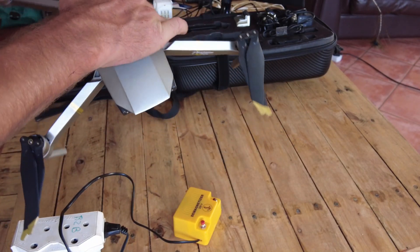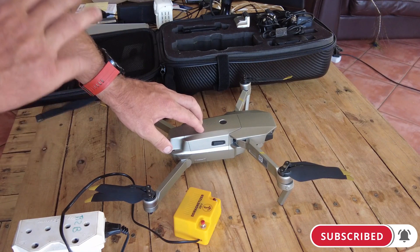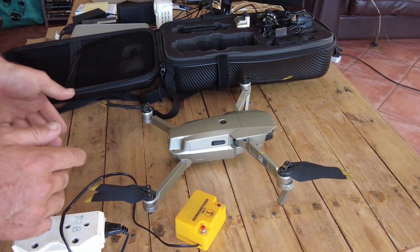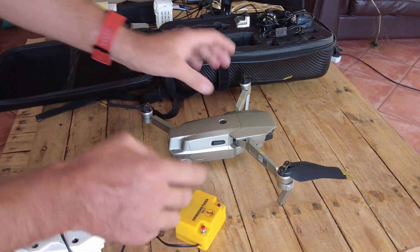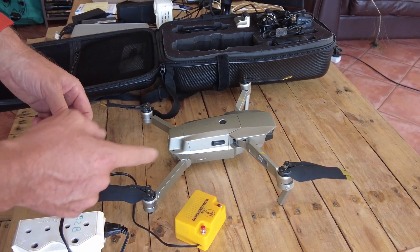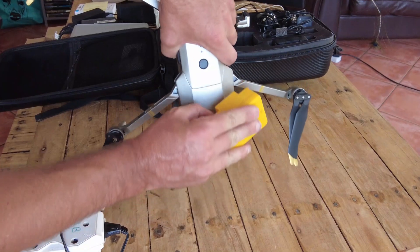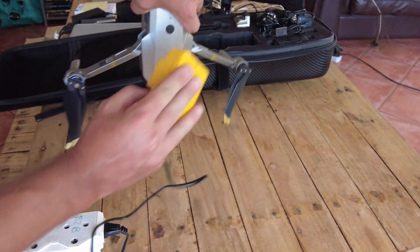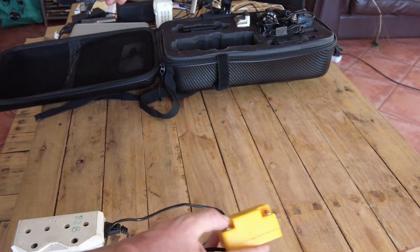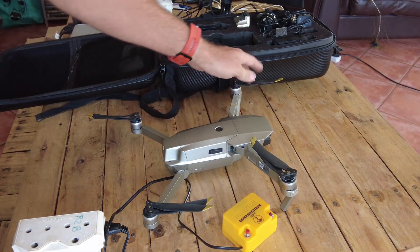In this scenario this drone just didn't want to calibrate — I calibrated five or six times and it just didn't work. I did the demagnetization, tried to calibrate, it didn't work. But every single time I could see the compass interference in the app starting to get a bit better. I'd just grab it again, run the demagnetizer over the drone multiple times, then from the front further and further away to decrease the magnetic field.